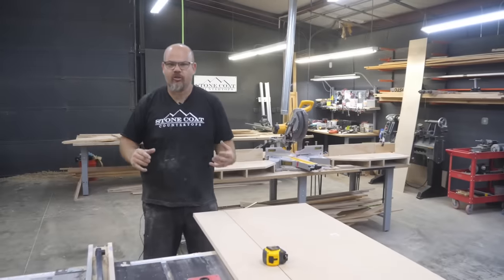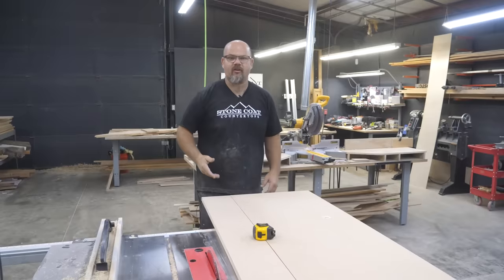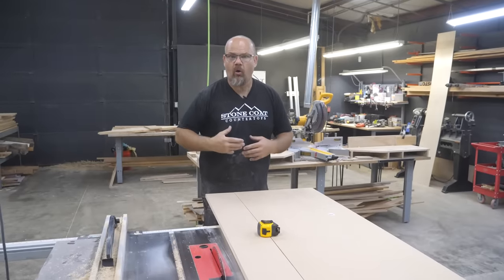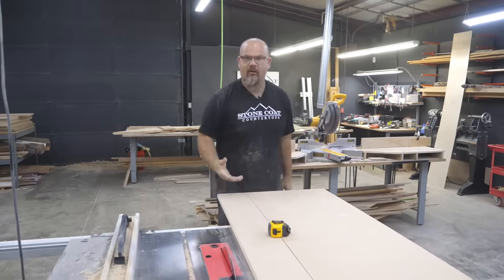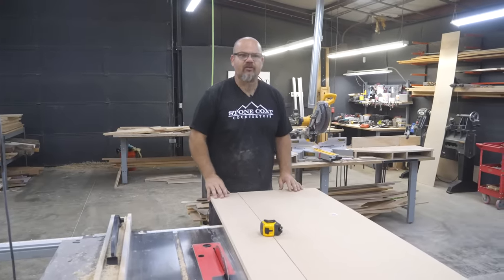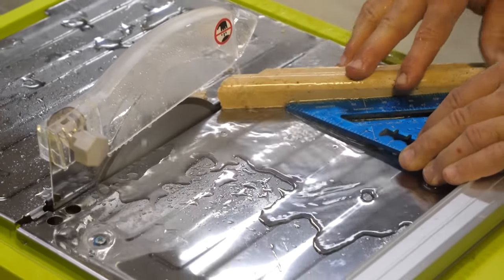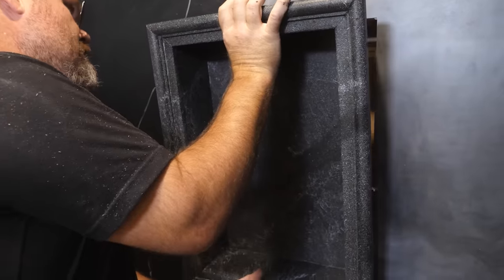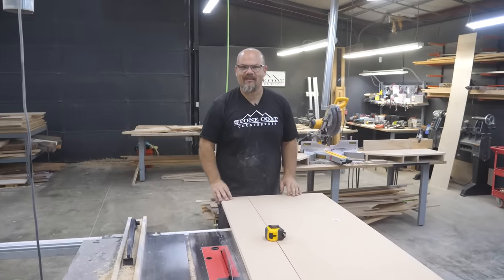Let's get started. We know that a 2x4 wall is actually 3.5 plus a half inch of sheetrock at minimum. Okay, so I got 4 inches. Then I got the thickness of my tile, but I want to make this work for a drywall, regular wall, as well as a shower or even an exterior wall. You could even put a light in the top so that you get light shining down on your favorite statue or figurine or something of that nature. So if I got 4 inches at best, let's go ahead and do it 3 7/8 just to be safe. We'll go 3 7/8 deep and then we'll put a lip on it or something that we can do a rough cut out of our wall and it self trims. It also gives you something to adhere the caulking to squeeze out and sandwich between the wall and your shelf so that you have a waterproof installation. Let's go 3 7/8 on our first cut.